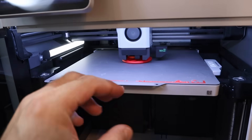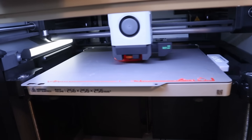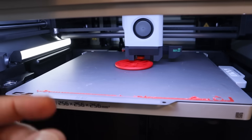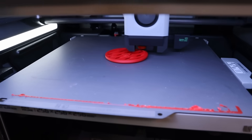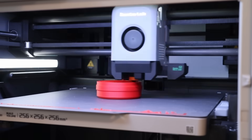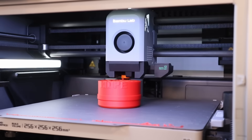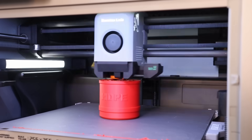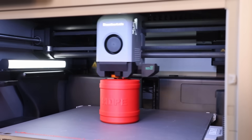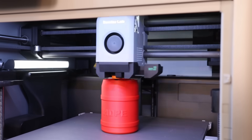It's a little bit dirty on the bottom but not too bad. This is going to be a 1.10 scale version of something I'm building for outside — kind of a neat experiment. It's not really critical whether it turns out perfectly because this is that 1.4 millimeter nozzle. You can see it's extruding a lot of material at once. I have it set to 34 millimeters cubed per second, so it is able to extrude quite a good volume. So far the quality looks pretty good, although I do have scarf seams turned on and at the back the overhang doesn't look great, but the rest seems to be doing all right.